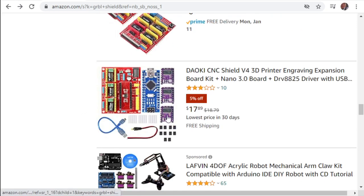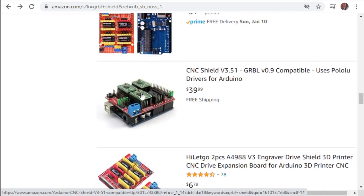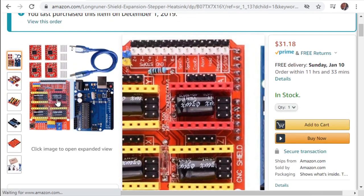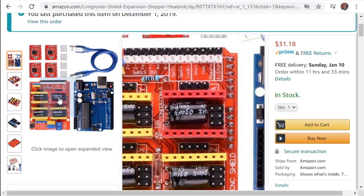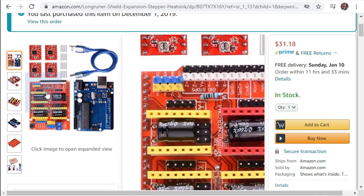There are lots of different options. A three-axis board would be great for little 3018 mills, but it doesn't have two Y-axes, which we want. On these boards, we can turn the A-axis - the red one - into another Y-axis. So you've got X, Y, and A, and you can set that A to copy the Y-axis. We want it to have its own driver too.